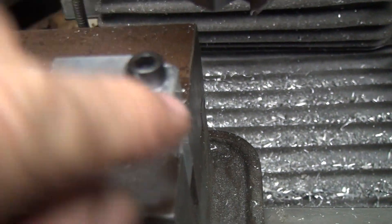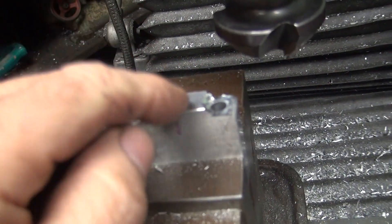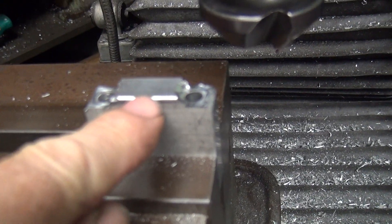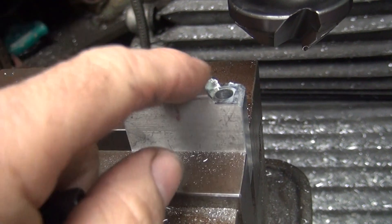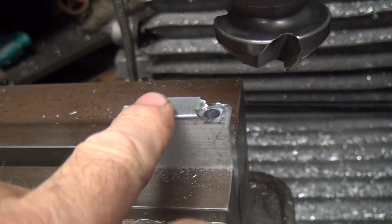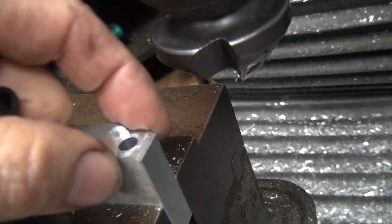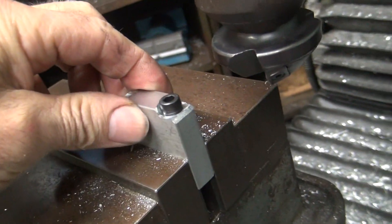The bolt drops in and we get the same amount of distance on both sides. The reason I have the same dimension is because I came off my center line right here, and I go equal distance off both ways so everything's equal. When you do it that way it makes it easy — whatever number you use on one side works on the other. If you come off just one side and calculate it, you have to keep track of more numbers — it's harder. So make it easier on yourself.